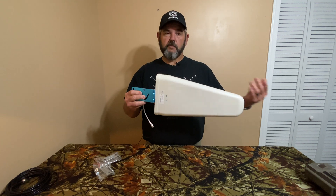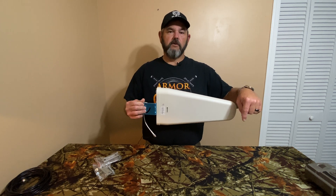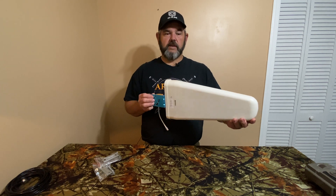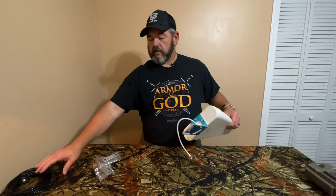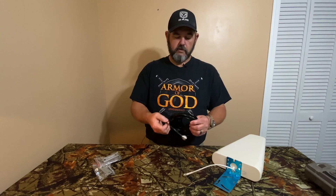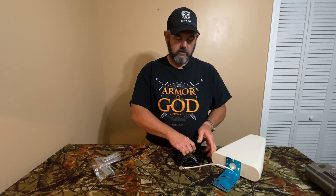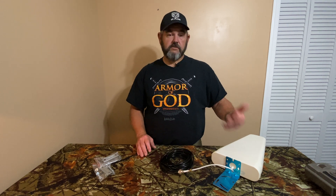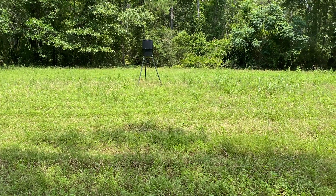There are online resources where you can find where your cell towers are — I'll put a link in the description so you can find a map of towers near you. You'll want to point the antenna toward the nearest cell tower. From my lease, it's almost due northwest. The antenna mounts to a pole with the provided U-bolts. The antenna fitting doesn't fit directly on the camera, so we have a 25-foot coax cable — one end fits the antenna and the other end has the fitting that screws right onto the camera.